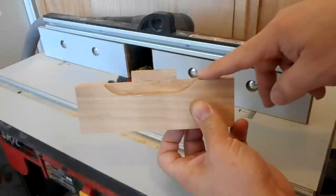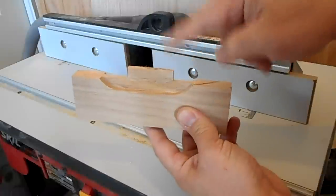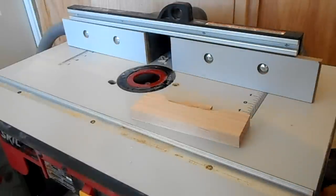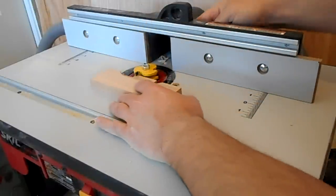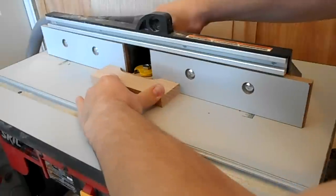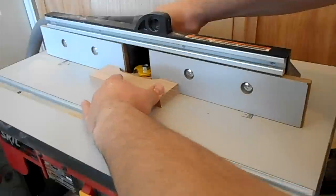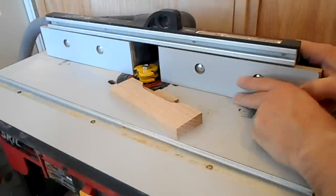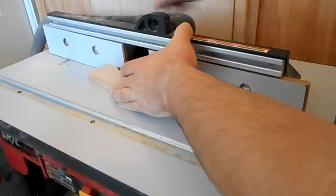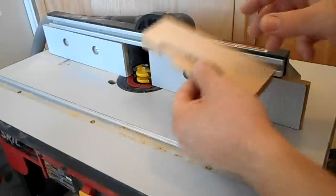I made another template for the slot cutter — it works the same way, setting the fence back so the wood only cuts in a quarter inch while the bit cuts top and bottom to make a quarter-inch tongue. You just put your bit in, bring the fence forward until it hits the bearing, and that's your fence position. The nice thing is it doesn't matter if your fence is straight or crooked — all that matters is how it fits to that bit and bearing.